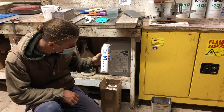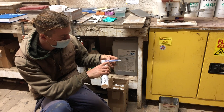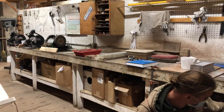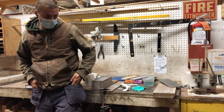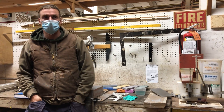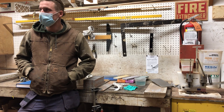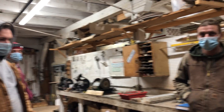Last but not least there's also 610, which is its own crazy monster. This is basically two sleeves of epoxy that go through a mixing wand — it's epoxy in a caulking tube. The UV and Sika Flex and those are a polysulfide-based glue, which is different. The 610 is mainly a convenience thing so you don't have to pre-mix the epoxy. It's a special formula with a specific viscosity so it doesn't sag, and it's got some silica in there — super convenient for things like sealing around a bolt or holding a fastener in.